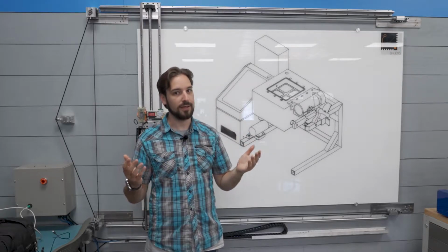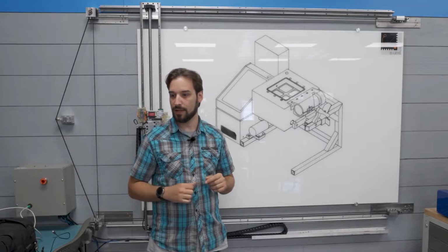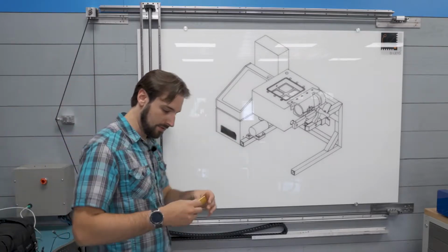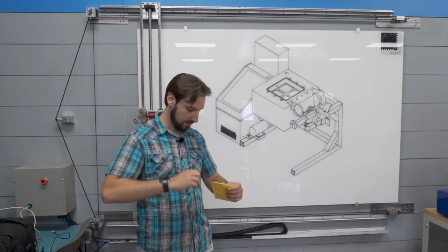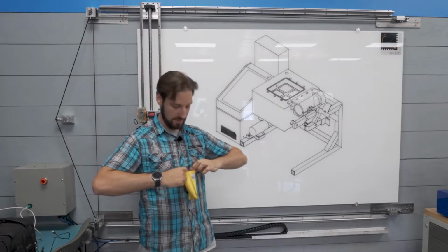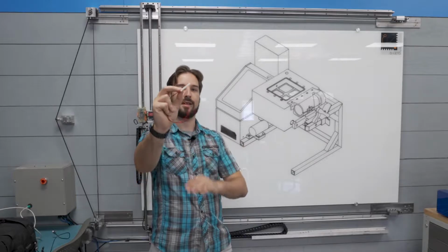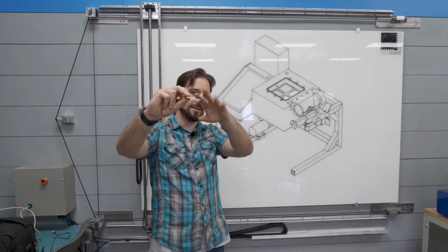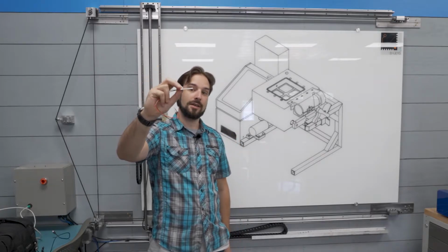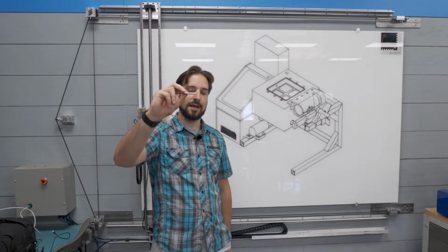And these are essentially electronic heat pumps. If I pass a current through them, it's a little plate. I have them somewhere around here, hold on. Here's one. Let me just open one of these. I think it's pretty important for you to see this, so I'll just go ahead and show you. So it's got two ceramic sides, and there's some electronics in the center. Technically those are transistors, or diodes, or something. I'm actually forgetting, but it doesn't matter.